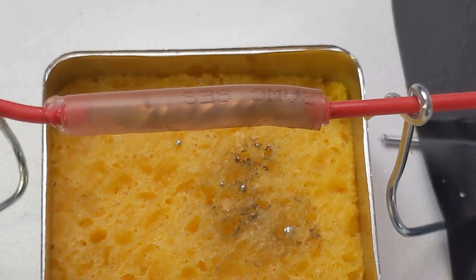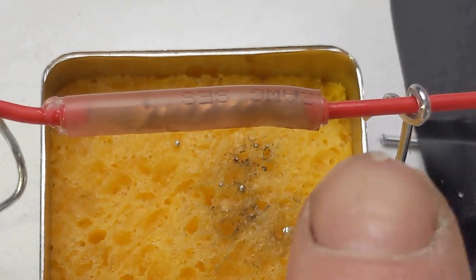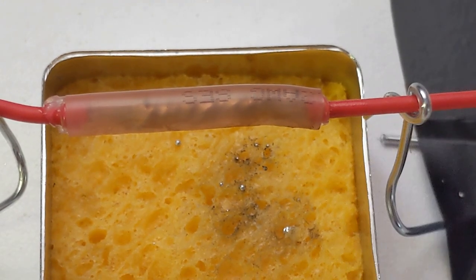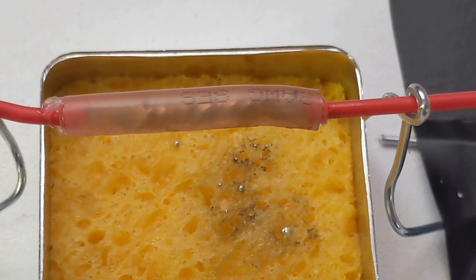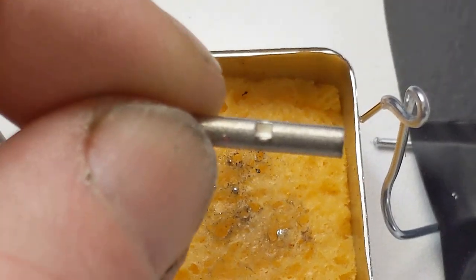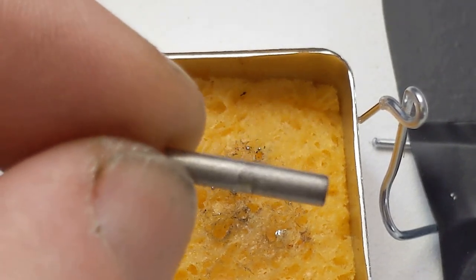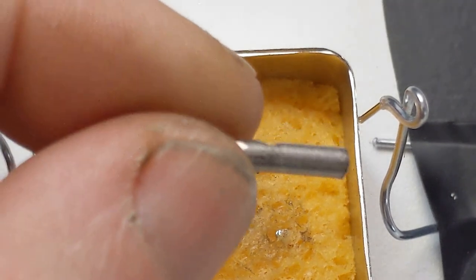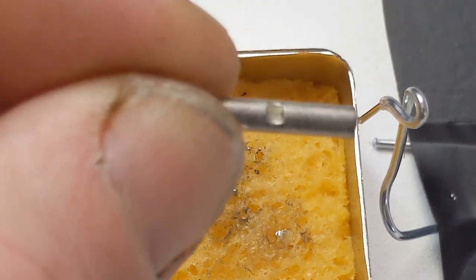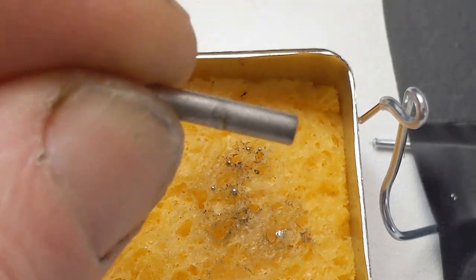I would recommend using a little more heat shrink — you can see we're a little short on the edges here. You definitely want to come back about half the length of your solder joint past the insulation. We also have these little butt connectors that you can crimp or solder. Most people typically crimp these, but they can make for a very nice, secure, automotive weathertight solder joint.